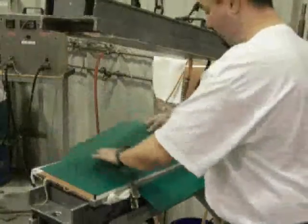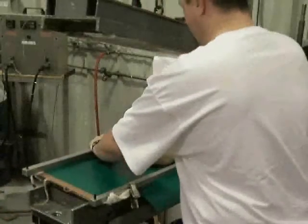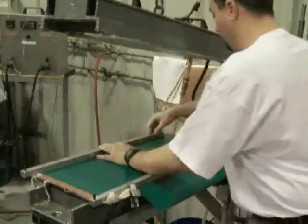When placing the second part of the splice in the press, ensure that you have a square cut by looking and making sure there are straight line edges between the belt and the flow bar.